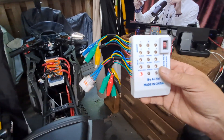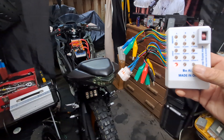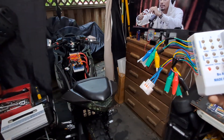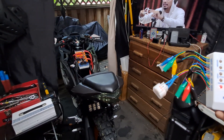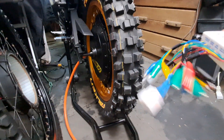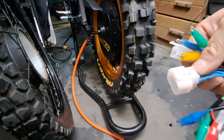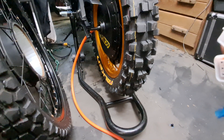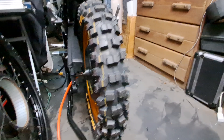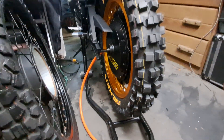What this is mainly used for — you can check pretty much anything with it. You can test the throttle, test brakes as far as high and low brake signals, because this has a positive 5-volt output. There's a lot of things you can do with this tester, but the main thing people use them for is testing hall sensors, because it makes it nice and easy, especially if you retrofit it with a normal hall sensor plug. It comes with one of those little tiny six-pin hall sensor connectors like some of the smaller motors have, but I have it with the plug that's on most motors.